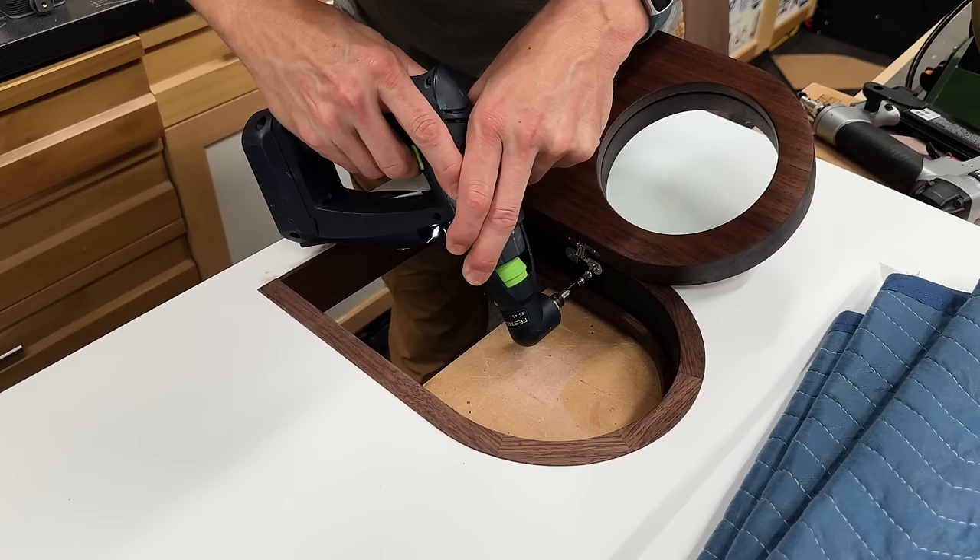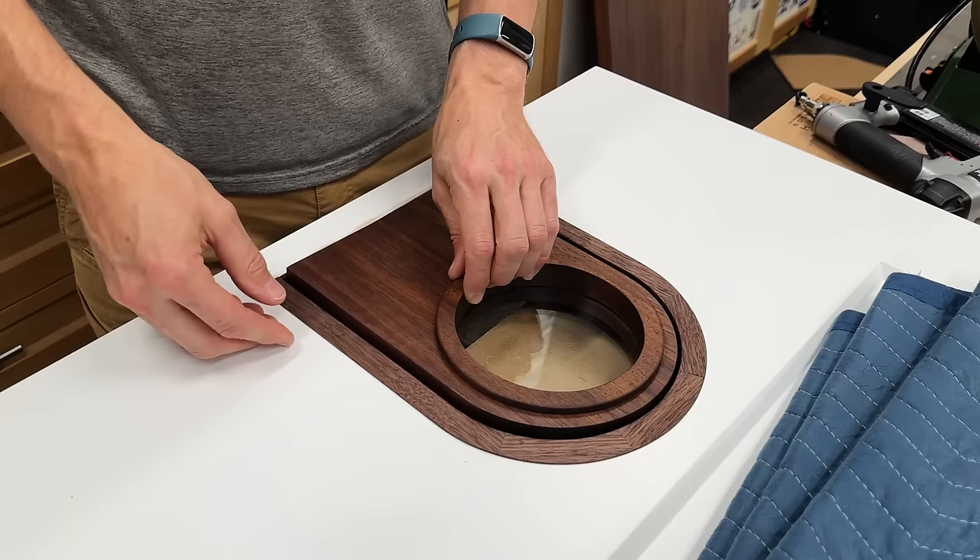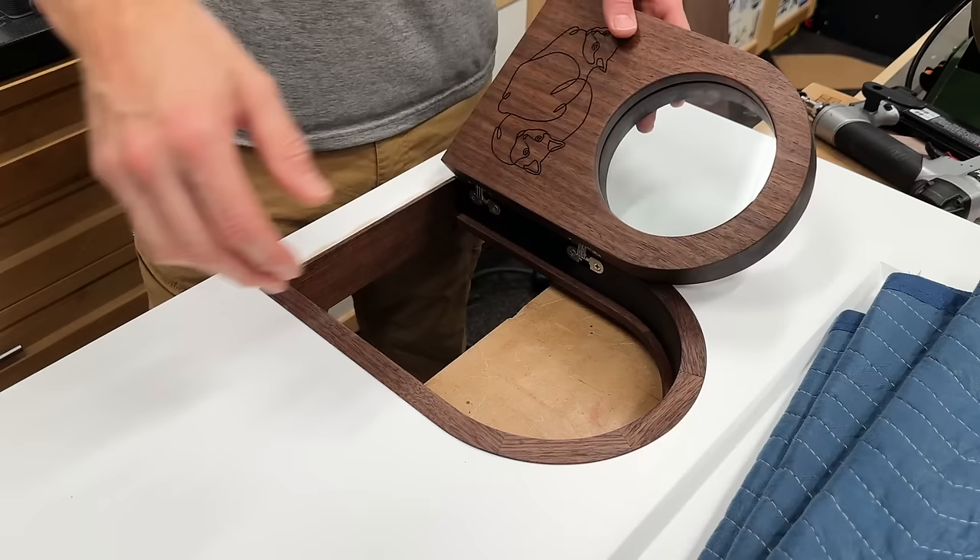If you recall, I mentioned a big mistake with the door trim on the inside of the door — it was very thin. I had three-eighths inch thick material and with the hinges in the correct position it basically added more thickness so the door wouldn't open. So I resawed the whole frame on the table saw, went over to my buddy Pete's and ran it through the drum sander, and ended up with effectively a one-sixteenth of an inch piece of trim all the way around. Man, who knew a small cat door like this would be such a kick in the fur balls!